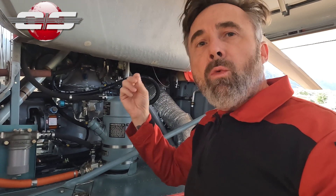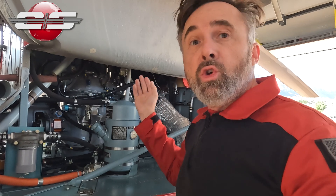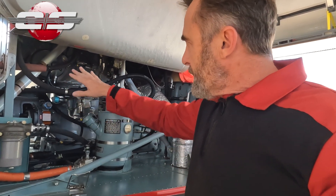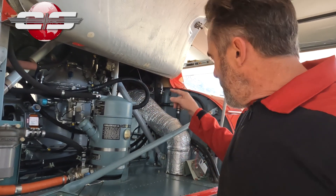If any kind of wear or damage goes into the metal of the bar, the bar is no longer airworthy and we need to put a new one on the helicopter. On pre-flight, we want to take a real good look at these from top to bottom, make sure that nothing's rubbing on them, and make sure there are no tooling marks that have been created on these bars.